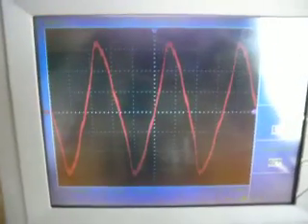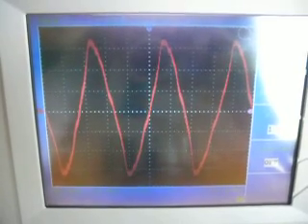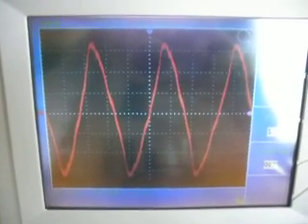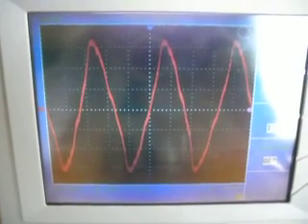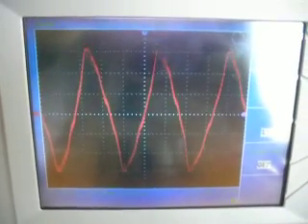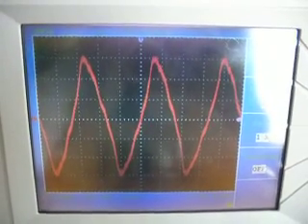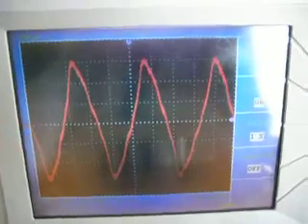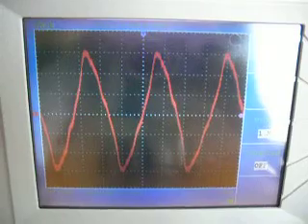One of the things I discovered last year is that my grounding system has this very large AC waveform on it — that's almost 4 volts peak to peak. It's 50 Hz and it's coming from the ground rods, and in turn that's coming from the utility system neutral. So the utility system neutral at my home is not actually at ground potential but instead it's actually at the potential of a few volts. The potential goes up and down during the day and generally it's at its worst around 6 o'clock in the evening.